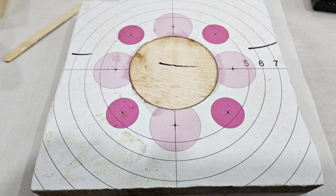I prefer 30-minute epoxy over wood glue since epoxy is much better at gap filling than wood glue. I also prefer epoxy over CA glue since it is supposed to have a much longer life. Why not 5-minute epoxy? Well, I don't like tight deadlines. By the way, I also marked grain direction to keep me straight.